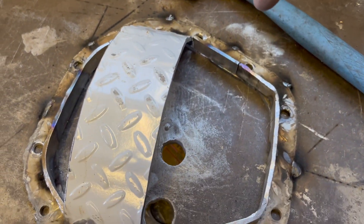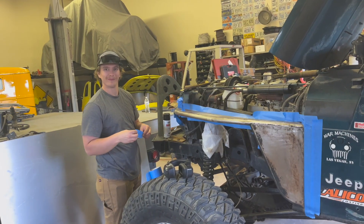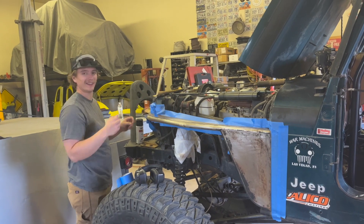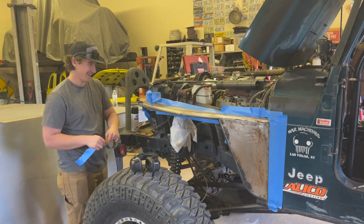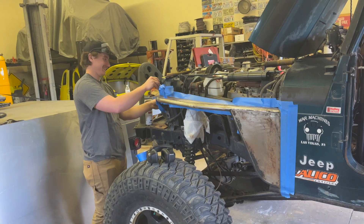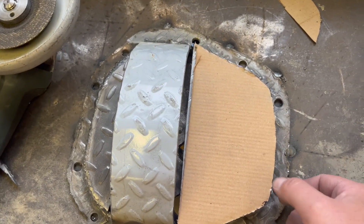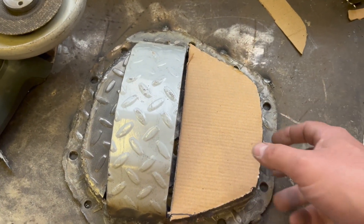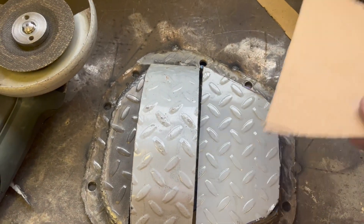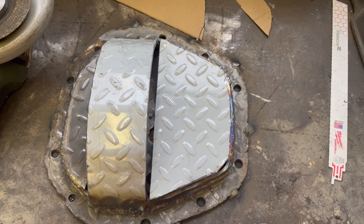The fill port goes right about there — it'll go in the flat spot here. This is exactly lipstick on a pig right here. I'm fixing the mistake I made like a year ago when I sanded it down without any paint and then it turned into rust. It's just patina — Preston Patina — put some lipstick on that pig. To cut these I'm just using some cardboard for a template — I just set it on there and hit it with a hammer around, just like when you're making your own gaskets, and transfer that to the steel, cut it with a grinder. Now I gotta clean up all that powder coating so I can weld this in.